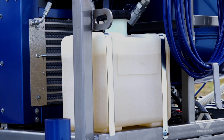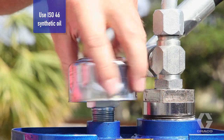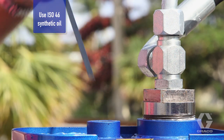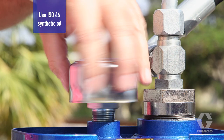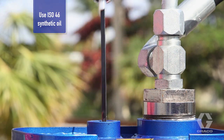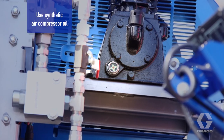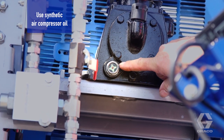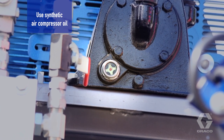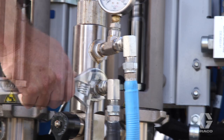Fill the fuel tank. Check hydraulic oil level. Add only synthetic hydraulic oil, ISO 46, with a viscosity index of 154 or higher. The hydraulic tank capacity is approximately four gallons for the road pack models and approximately eight gallons for the road pack HD models. Check the oil level in the air compressor. If the red dot is visible, add SAE 30 weight non-detergent air compressor oil. Verify all hose and fitting connections are tight.